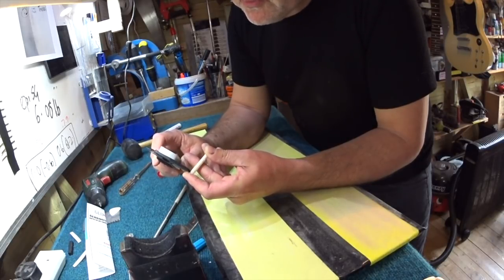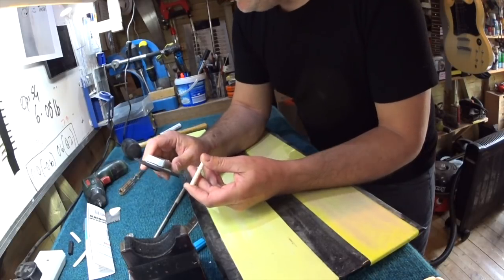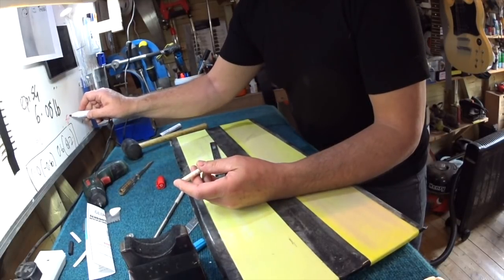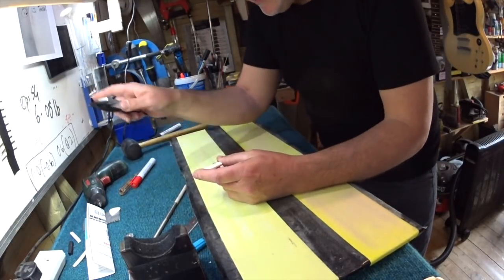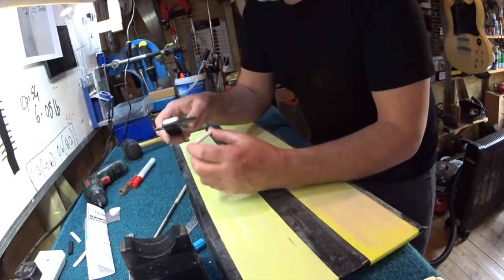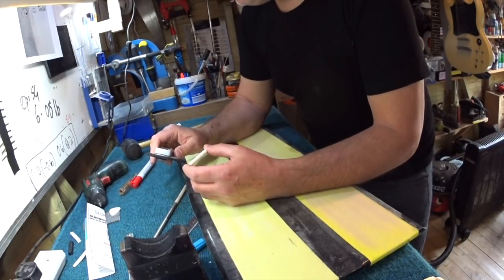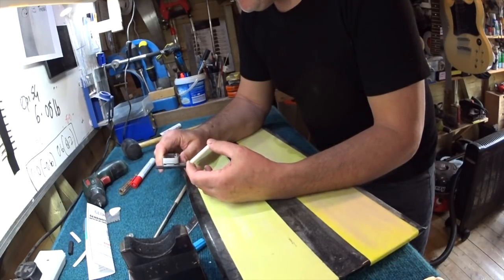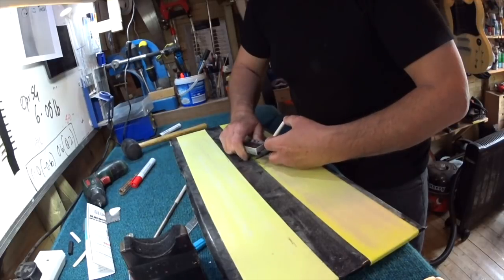So we're probably best off running from the top edge here, in this case. So we're going from 8.2 to 8. I don't really care. Those are only reference points, so I don't care that the numbers don't look the same. Right, so I'm going to put this one, we're doing this one inside the groove, and we want to go to 7.6. We're going from 8.4 that's stable down to 7.6, which is fractions of a millimeter, as you can see. Can't seem to get it to 7.6, 7.5, 7.6, right.